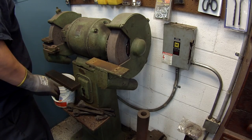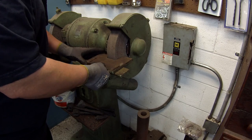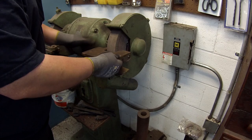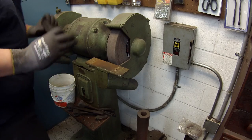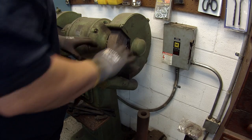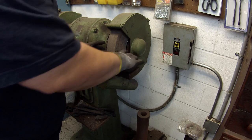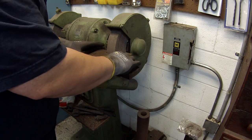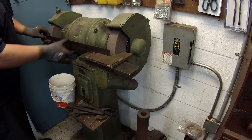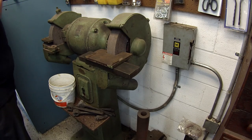I took the plate off. Here's the plate that was mounted on there — you can see two holes where it bolts down. I don't know if this is an original piece of the machine; it seems like it would be, but I really don't know. There's even been a torch cut right here to give a little clearance. Here's my one-inch plate that I'm going to use. This will be bolted down, and then I'll have this plate mounted on top — that'll bring me to the right height I need. This side's good; I can lay one of my scales across here and it's just about the right height.